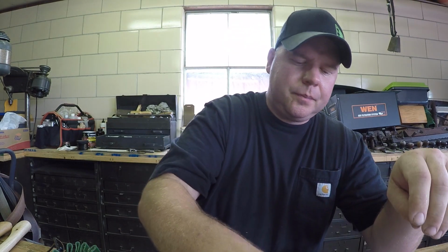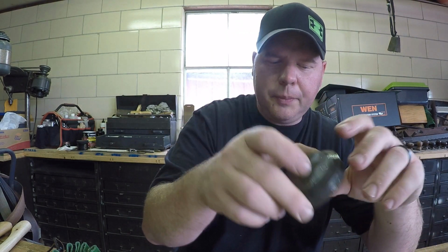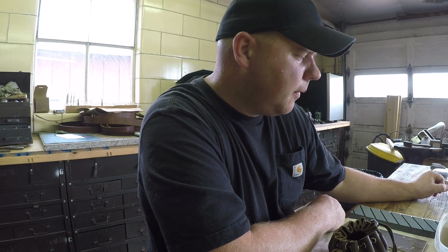A Lansky Puck is a 120 and a 280 grit, so it will remove metal much quicker. Now the downside to that is it does not leave as refined an edge as the Arctic Fox. No matter which puck you use, they'll both cut as long as you use them properly and you understand what their intended use is and know what results to expect from that puck.